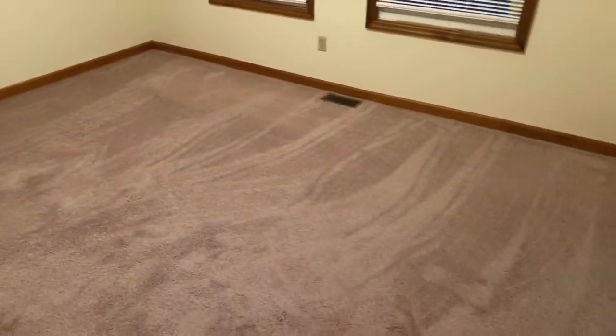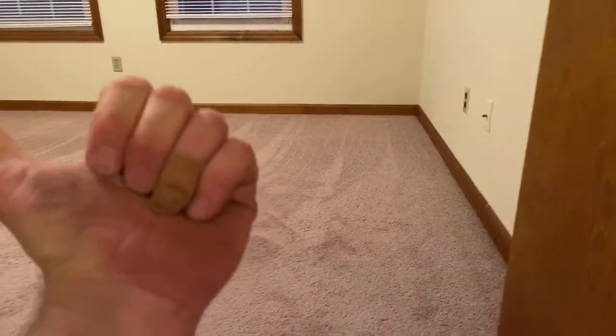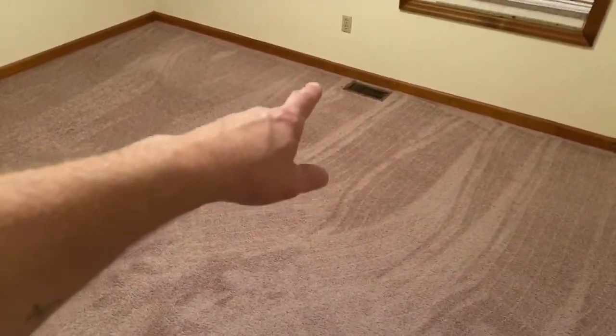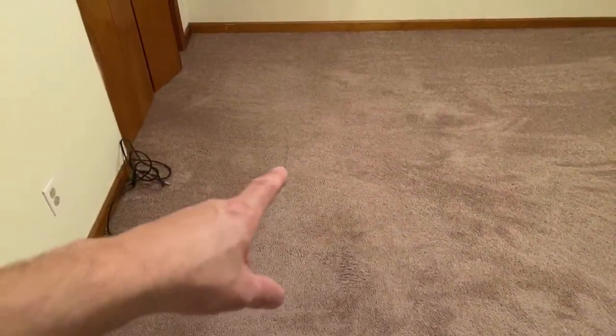You can see how many wrinkles there were right here in this carpet — a whole bunch. The whole house looked like it did in the living room. These marks here are not wrinkles — look here, nice and tight carpet right there. We stretched that way, kicked it this way, and stretched that way. A lot of times you don't have to stretch both ways, but sometimes you can push up a wrinkle even after stretching one direction.